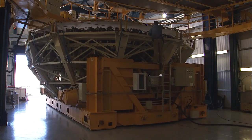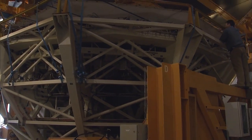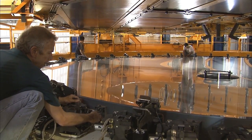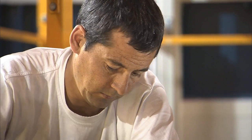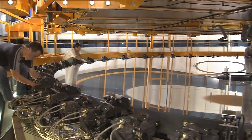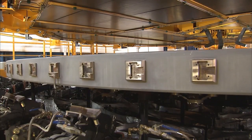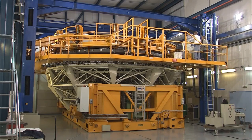The first task at the mirror maintenance building is to remove the mirror from the carriage in its cell. The carriage is positioned under a custom-made handling tool. Brackets connect the mirror and the cell, and engineers have to release each one manually. This may sound like a routine job, but with the sensitive mirror surface only centimetres away, it requires the team's undivided attention. Forgetting to take off even one bracket could damage the mirror severely during the lifting operation. The team is only ready to lift the mirror off its cell after a triple check of every bracket. Hooks are lowered to bear against the back of the mirror, and the handling tool lifts the mirror up and off the cell.